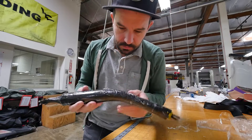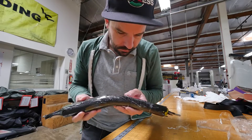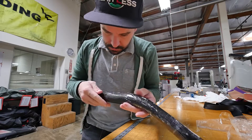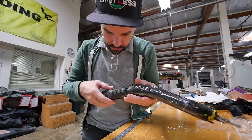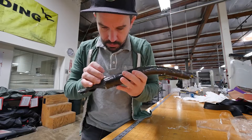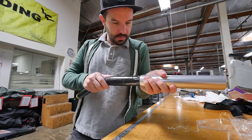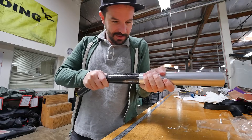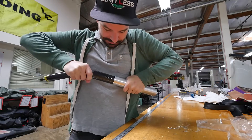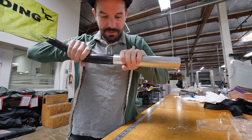As predicted, I had these voids — these kind of creases where there were voids in the heat shrink film. The part should still work out and yeah, it's looking pretty good. Now, does it fit in a 42 millimeter tube? Oh, look at that — nice and snug, just what we need. Perfect.